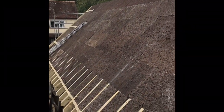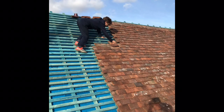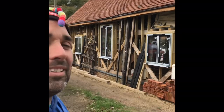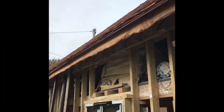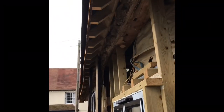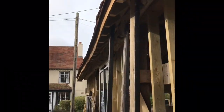I'm rather proud of this — the same tiles off the roof mortared on the ridge, sorry on the gable, and I think it looks rather smart for my first time doing clay peg tiles. I've got a waney edge weatherboard and a waney edge fascia board under there, which is local cedar that was cut down on the local estate. You don't have a soffit — you just see the pre-painted black board under there and the little sprockets.